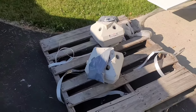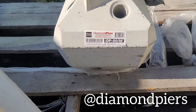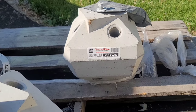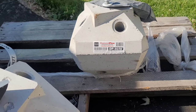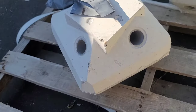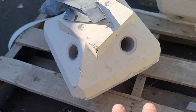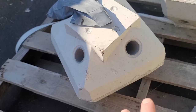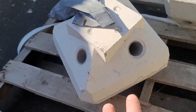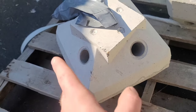Welcome back to the channel. Today we're talking about these little guys right here - Diamond Piers. This is the Diamond Pier foundation system. What these basically allow you to do is set your foundation and build in the same day, which is awesome for deck builders and remodelers - situations where you don't have time to bring in concrete or don't have the weather to wait for concrete to dry. I'm not saying this replaces concrete fully, but it definitely does in some situations.